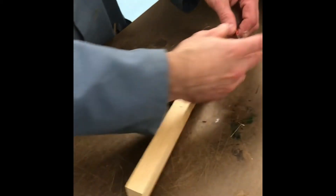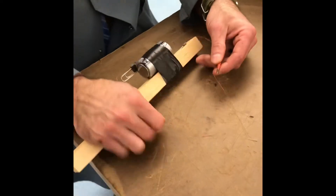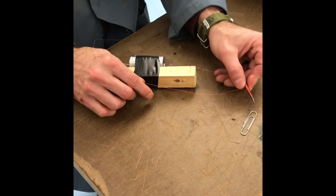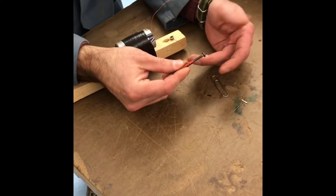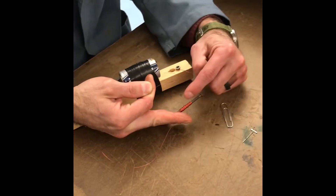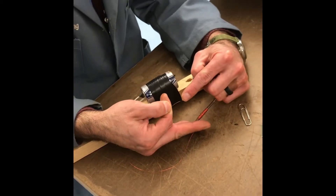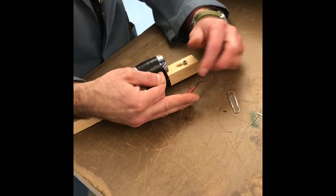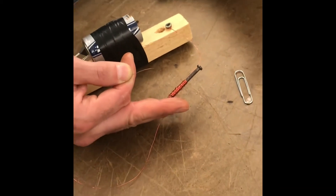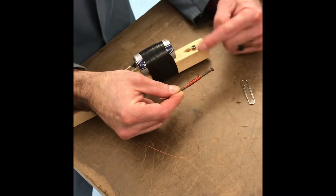Here's a different way to do it. I have over here a coil of wire wrapped around a very similar nail, and as of right now I can't really pick that up. This is called magnetic wire — notice the color difference. This red color is a casing on it; it's painted on there and it's non-conductive. So on the ends, to make them conductive, I had to sand that — you can see the copper color here versus the red color here. If they were conductive, electricity would just run straight through it, when I actually want it to run in a coil.